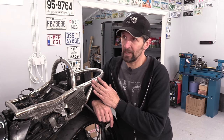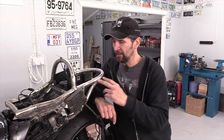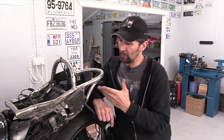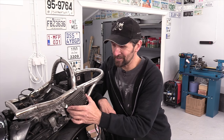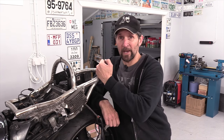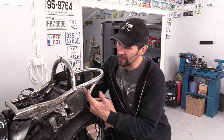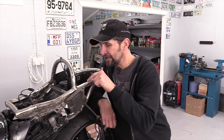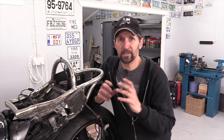Now, this is a steel tube, top quality stainless steel tube, 316 seamless food grade steel tubing, and I put stainless steel heavy duty riv nuts in it. Now, obviously, that's strong enough to hold just a humble little regulator rectifier. That's not going to be the issue. And there's no weight going to be on this back section whatsoever. And the holes are behind the point where there's any weight. So no issues whatsoever.